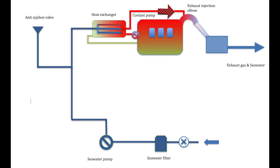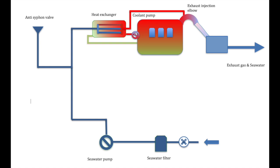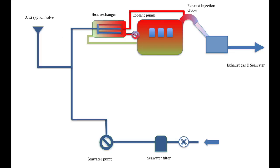It's this exchange between the coolant and the salt water which gives the heat exchanger its name. The now hot seawater is pushed into the exhaust elbow. We've done a couple of other videos covering the problems around exhaust elbows and water injection - I'll put a link in the description. The hot seawater and exhaust gases will be pushed down the pipe into a muffler or water lock. Some boats have a separator which separates the exhaust gas from the raw water, allowing them to run a dry exhaust from that point forward. In addition to the engine heat exchanger, some engines have an oil heat exchanger which cools the oil, working on the same principle.